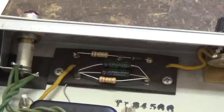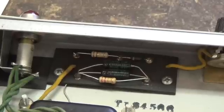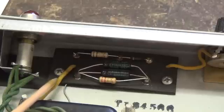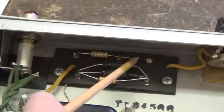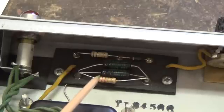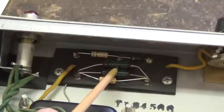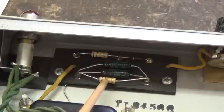Here's the amp we'll be working on today — it's a 1966 Fender Princeton Reverb, and we're looking at the bias circuit up in the upper left corner by the indicator light. Here is the wire bringing the 330 volts from the GZ34 pin 4. We go through the 100k ohm resistor and through the diode. Here is the 50 at 50 smoothing capacitor — in this case they're in parallel to get the right value. And here is the 27k resistor to ground. This is where we're going to make our modifications: this becomes a 50 microfarad at 100 volt capacitor, and this is going to turn into an adjustable pot with three outputs.